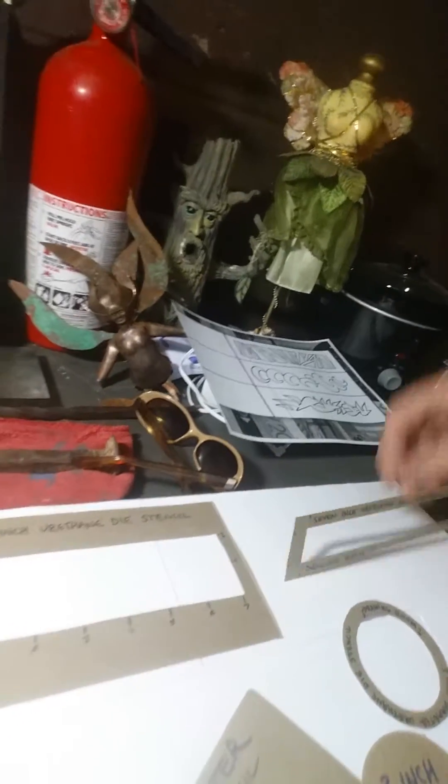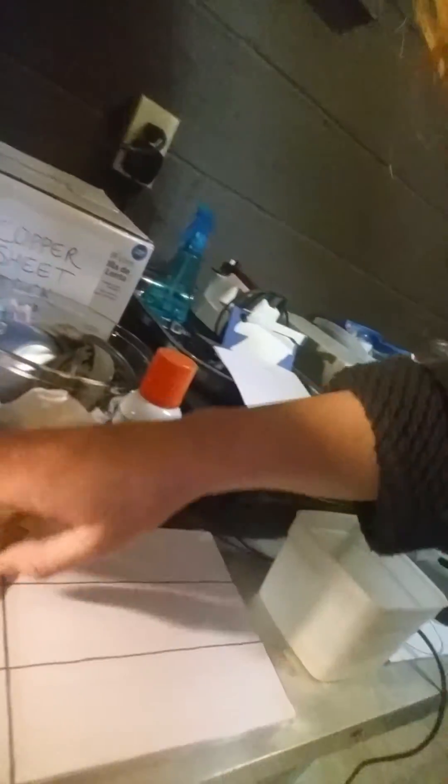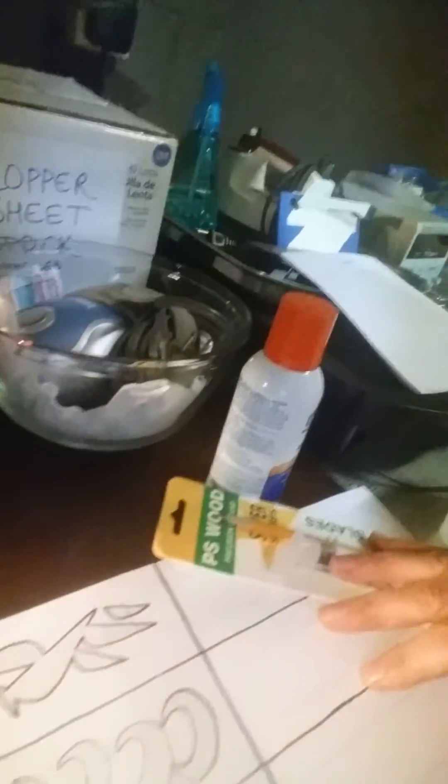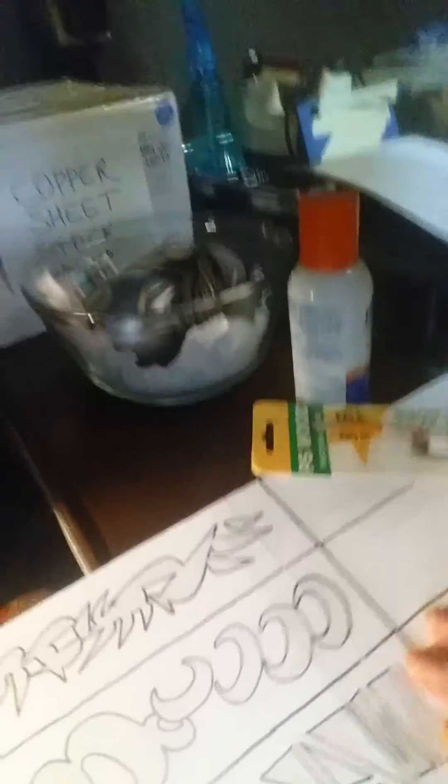Using those stencils, I draw and then draw again to create spots where I can illustrate what I want to put in the die, and then I'll cut that out with the scroll saw. These are some dies I intend to cut out for my bracelet urethane. I picked up a lot of quarter-inch-thick plexiglass scraps from Lowe's — they gave me the whole pile for 50 cents. You score them and snap them into usable strip sizes.